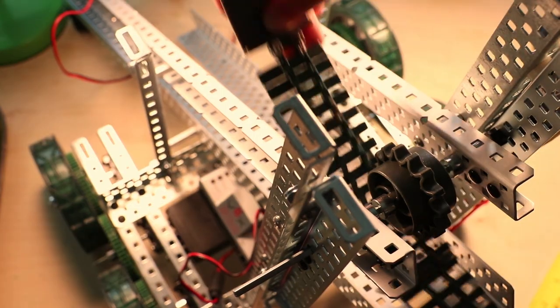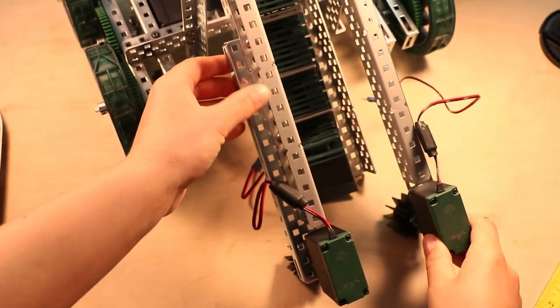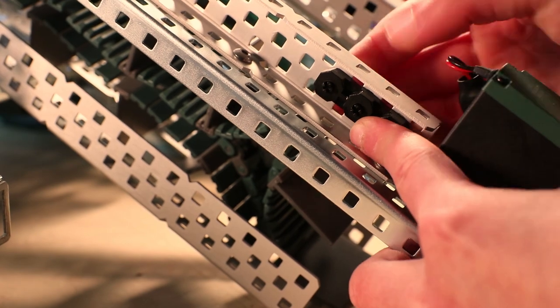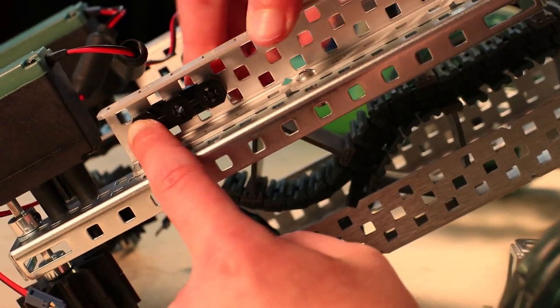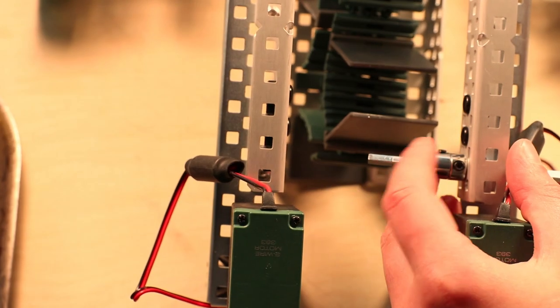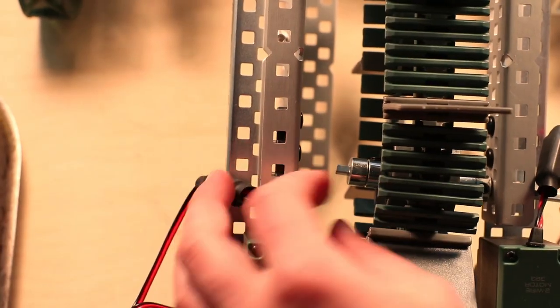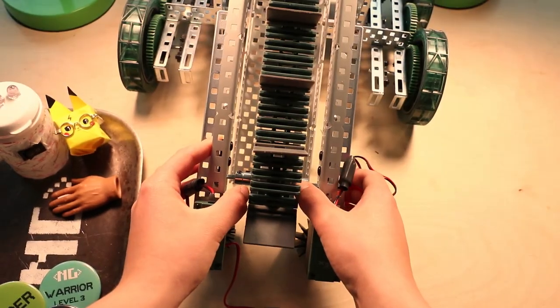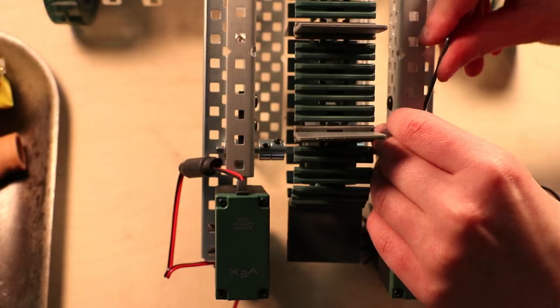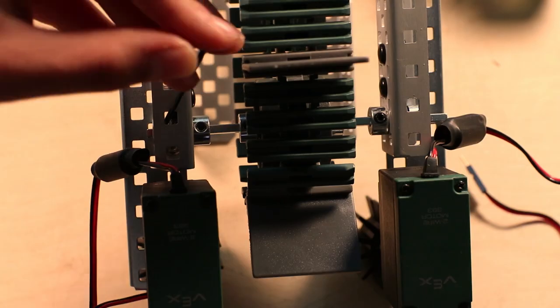Now you're gonna link the ends of the tank tread around that drive wheel and let it sit for a second. Now grab the last 2 bearing flats and place them on the last 3 holes in the middle column of the C channel. And you're gonna secure the center and back holes with pop rivets. Grab your 4.5-inch shaft, then you're gonna slide on 2 shaft collars, the tank tread wheel, but only after you loop the tank tread around it, 2 shaft collars, and then through the other bearing flat. And then once you have everything centered, you're gonna slide a shaft collar on either end, tighten them all down against the edges. You should now be the proud owner of a partially built QUAFFLER.